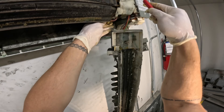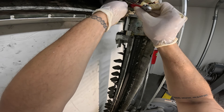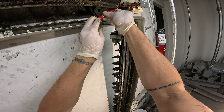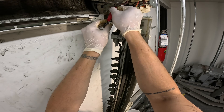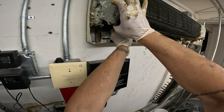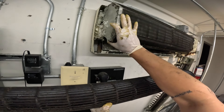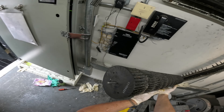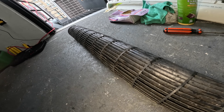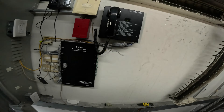I think I got it. I have some long allen keys but instead of waiting, I'll try to use this shorter allen key with the adjustable wrench. Got that loose. So a couple screws here — move this out of the way. And I got it out. Let's make sure you put this in the right way. On this end right here, got that little allen key right there to loosen it from the motor shaft. Take a look at this, guys — this is the air that you're breathing. These units really get really bad and you really want to do some maintenance on these.